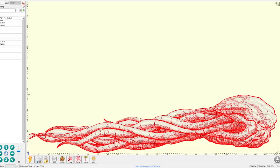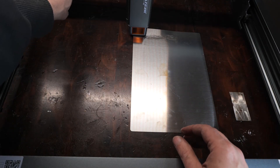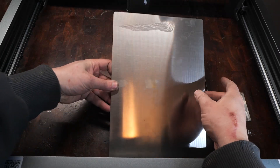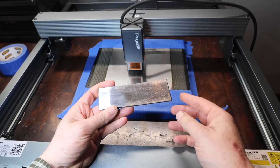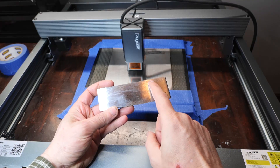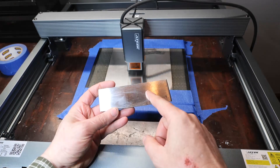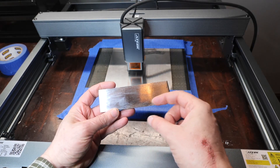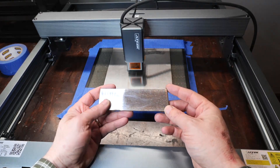We're going to load up our Cthulhu design and see how it looks on some sheet metal with a quick pass. The definition is going to be good, but we have to etch deeper — that's the question. Will the definition hold up with these really fine lines as we etch deeper? It might be a bit of a balancing act. I think the next step is to laser in an outline, do the head, maybe just outline the tail, and then shape the piece of metal and go back and do the full etch.